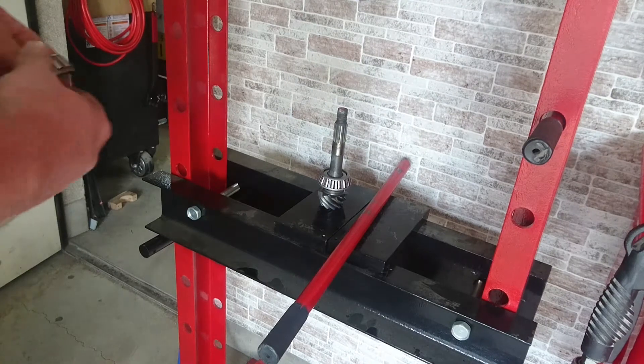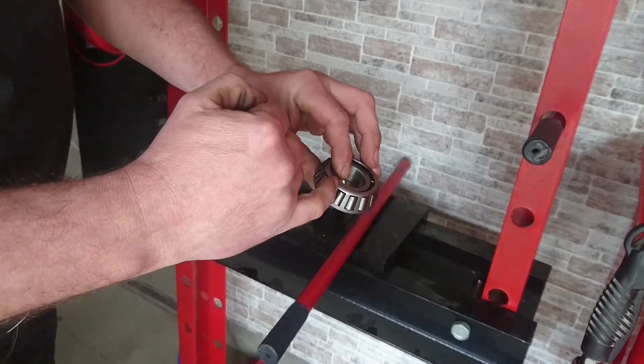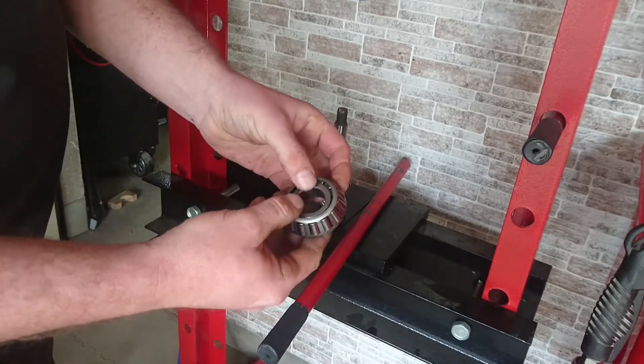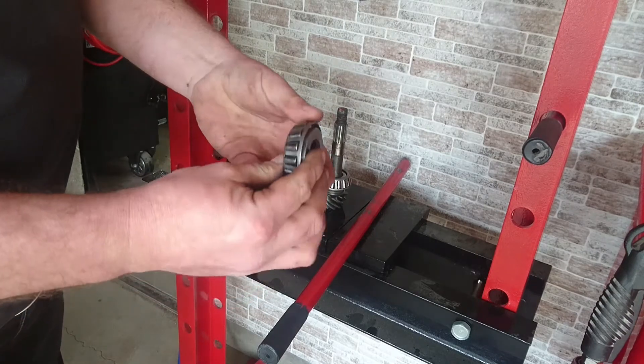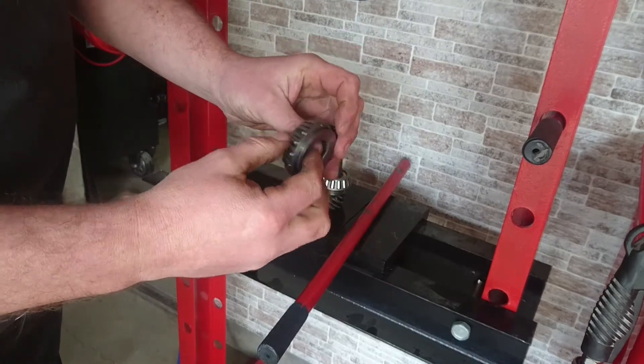What can I use? After much thinking about it - this is the old bearing. What I'm going to do is cut this off, and then I'll be left with the inner race. I can just use the inner race to push this on. Once it's on there, there's a lip there that I can just use the bearing puller to pop this back off again.